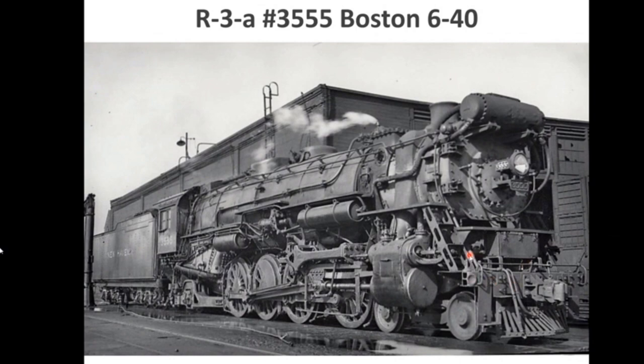These are a three-cylinder locomotive. So again, it has this on the front. This has something to do with the fact it's a three-cylinder locomotive. The other one's buried under here and all the linkage in the center. These have cast McClellan smoke boxes and boilers. So this is a cast smoke box, and the steam lines here are all cast into this one part here. These came with the feed water heaters, came with the ATS up front.